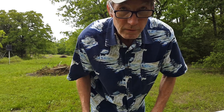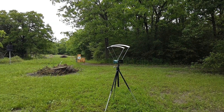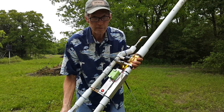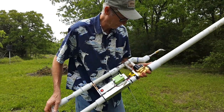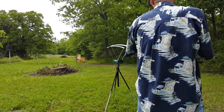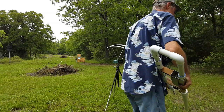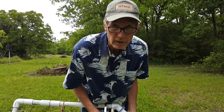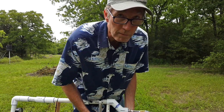I'm going to pause the video now and change out the guns. Okay, I'm back. Gun number two, 46 cubic inch, Luxor solenoid valve, golf ball, 300 psi. Let's see what happens on the chronograph — we're going to compare all three of these guns. Louder noise, but less feet per second — got 330 feet per second. I'm going to pause the video again and we'll try the last gun.